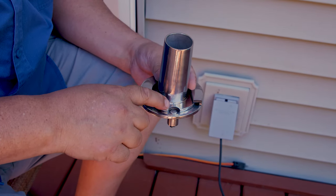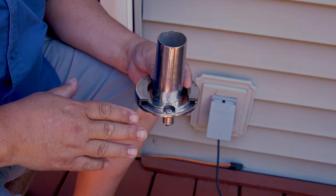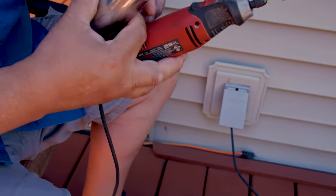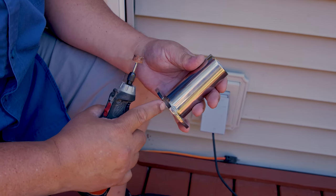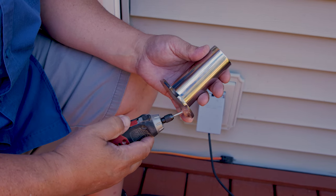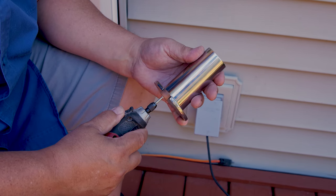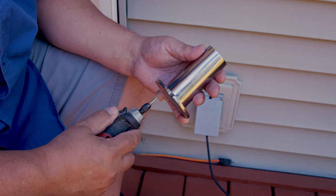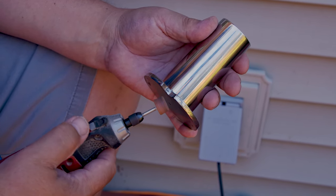Some bases — if you flip them — the button may not come up because the tolerances are fairly tight. If you ever find that to be the issue, all you need to do is remove the receiver and use a Dremel tool with a stone on it. Don't use anything metallic because metallic abrasion systems will leave residue on the stainless steel and cause rust. But if you use a stone, you can put safety goggles on and polish some of the stainless steel until the button pops up. This may be required if you want to flip it so that the angle is different.